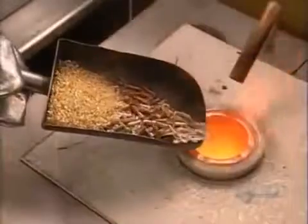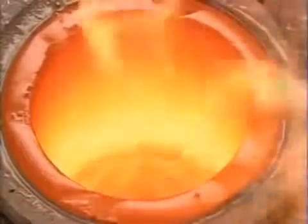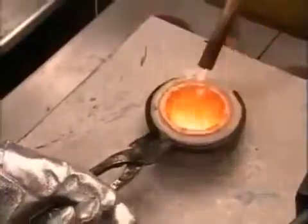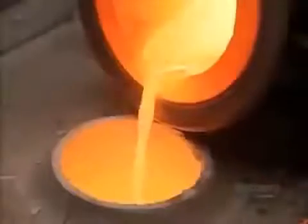They melt the mix in a crucible at 1010 degrees Celsius. Just 3 of these scoops are enough to make about 5,000 14 karat gold chains. A worker pours the molten alloy into a casting machine. Water cools the metal to around 370 degrees Celsius, solidifying it. The metal passes through a round die, which shapes it into a golden rod that's nearly 2 meters long.